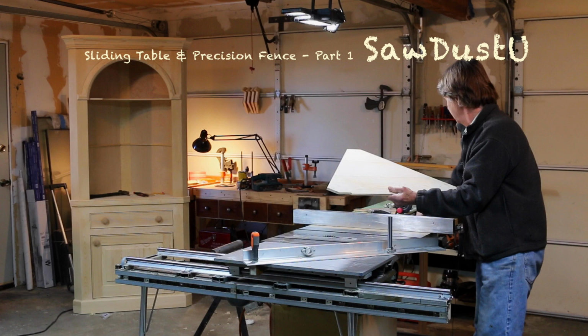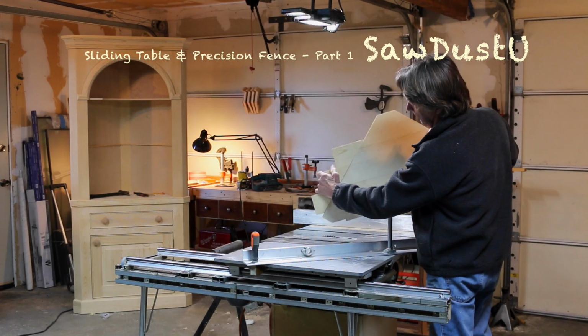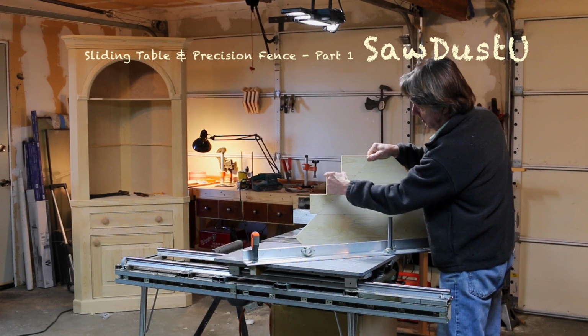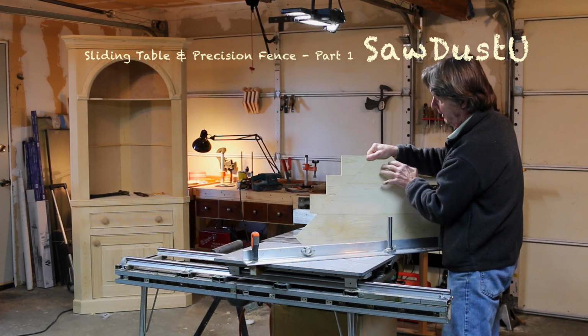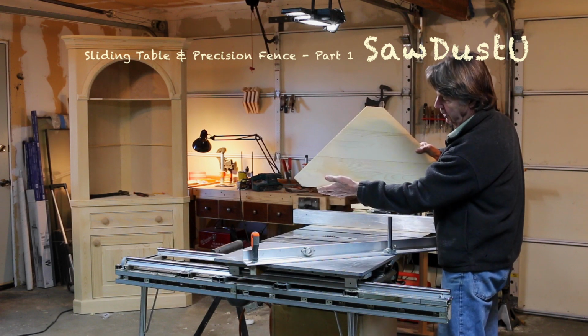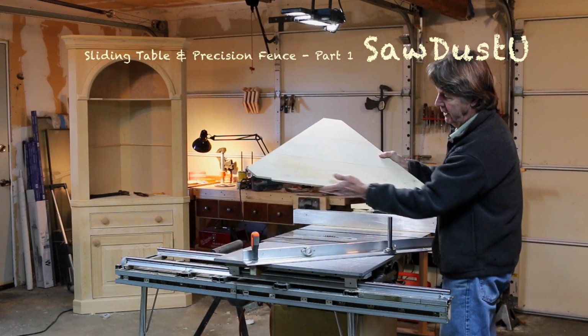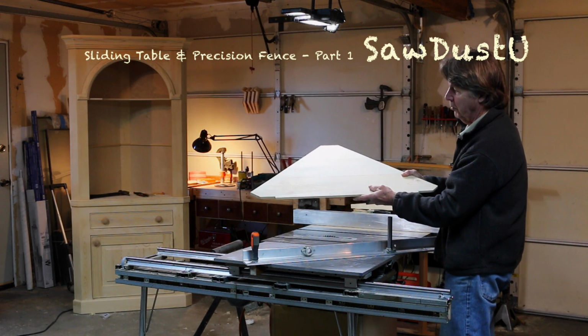Now initially, of course, when it's glued up square, you have this sort of a look where your boards, you get there, and that gives you a clamping space as you edge glue up your panels. So what you do is you run your long edge through your jointer. That gives you a dead straight line for your reference point.